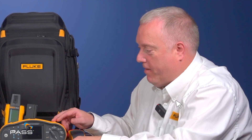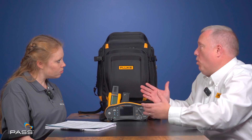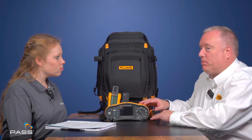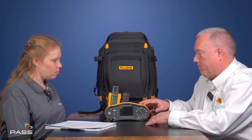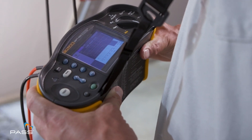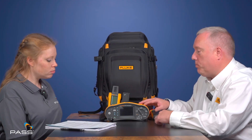This is the unit we have here. SMFT stands for Solar Multifunctional Tester. We've brought a unit to the market that enables the user to test the whole solar panel array and all the electrical measurements associated with that. What's unique on this product is an IV curve trace, which can be displayed on the screen — something not every product currently does. That's something Fluke have brought to the table for this unit.